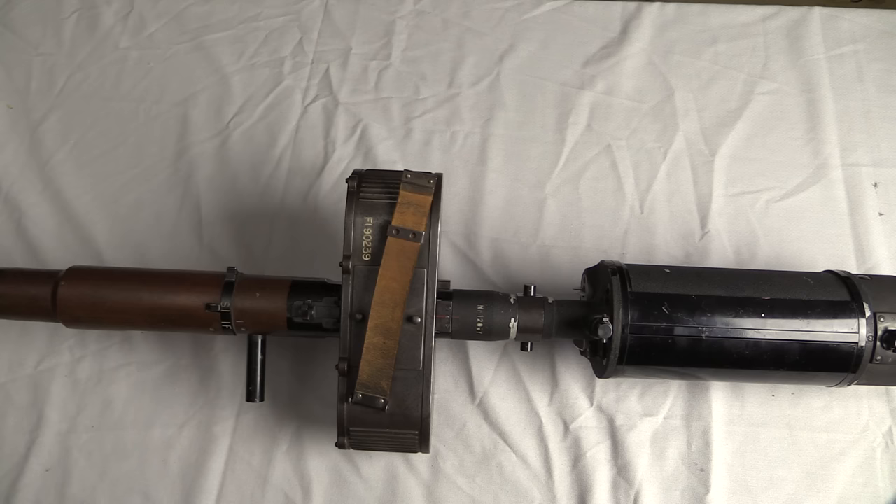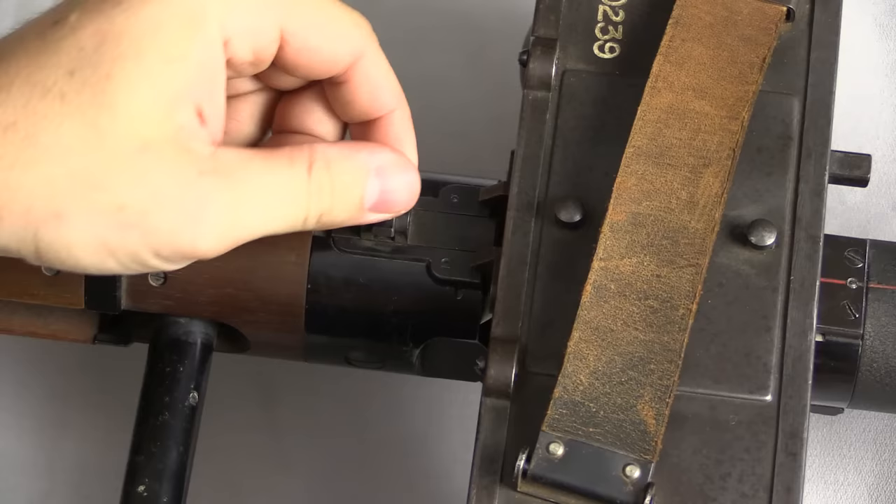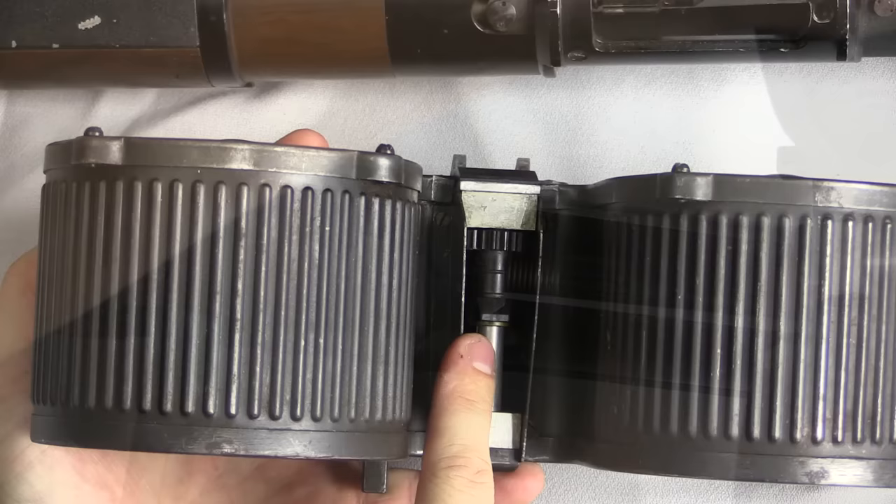The technical name for this is actually a Leitz MGK-1000 camera, which I haven't mentioned to this point. I'm going to start by pulling off the magazine. This is actually pretty similar to a standard MG-15 — we have a safety catch here to hold the mag on. I'll flip that to the right, then pull it back, and then tip the magazine up and out.